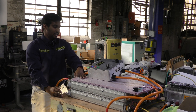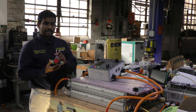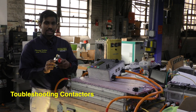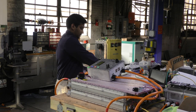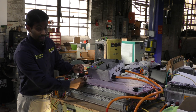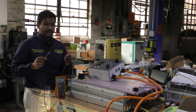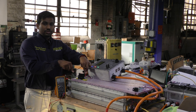We've had multiple customers with a problem where the Gigavac contactors inside this unit have gotten welded. You can see physically there aren't any burn marks or damage — we just have a red sticker identifying it as bad. But if I do a continuity test across this contactor I'm reading 0.1 ohms, which means it's shorted — and that is what you don't want to have in a contactor.